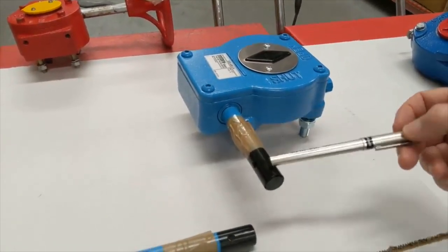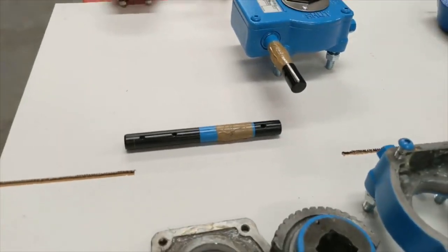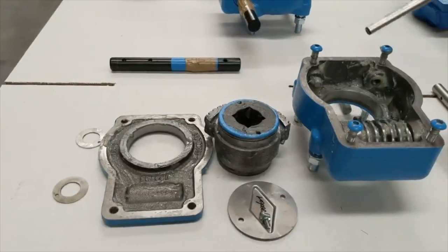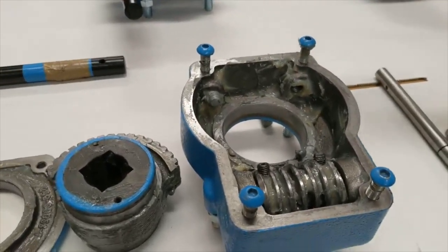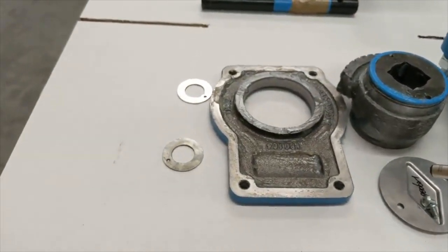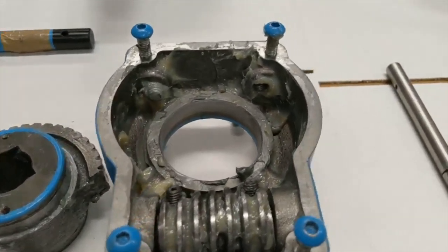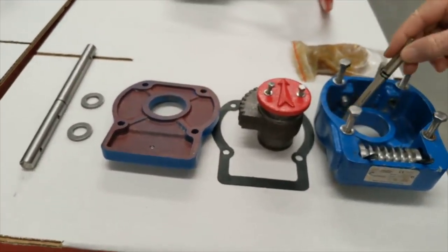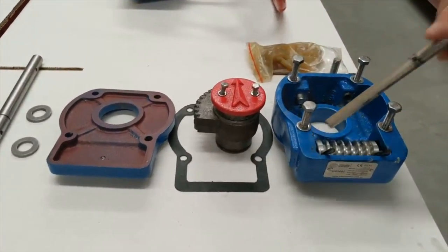The indicators on both are very similar. The Rotorq has just painted steel external componentry and a plain painted steel shaft. Looking at the internal breakdown of the Rotorq unit, the inside is not treated in any way — that's just grease in it. The lid has no treatment either, and there's no seal around the mating face — it's just metal to metal. On the Process Systems unit, both castings have an internal treatment and there is a gasket between the lid and the body.